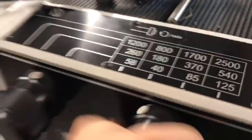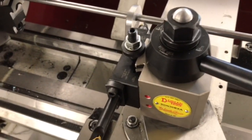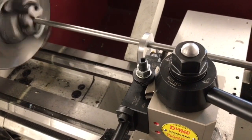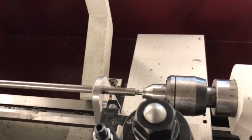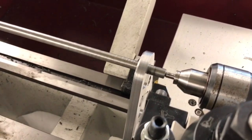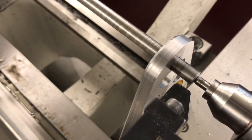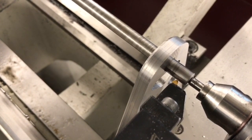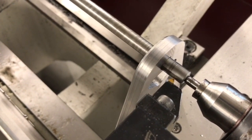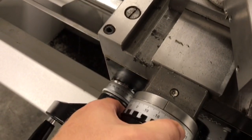Because I am doing a relatively small thread, this would normally be a pretty high speed. But with threading, you're generally running as fast as you feel comfortable with. After everything is set up, I can move over to the starting position, bringing in a touch off just like I would normally do. I have my compound set to 29 degrees just like I would for normal threads. You do want to run a little bit of cutting oil on the piece to help provide some lubrication, because you do not have a huge amount of clearance. And I also wouldn't go crazy with RPM — even though I'm comfortable threading at say 800 RPM, I would not run it that fast because of the limited clearance, which would create more heat buildup.